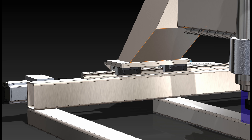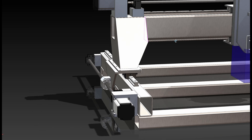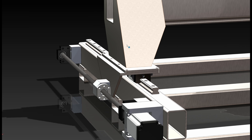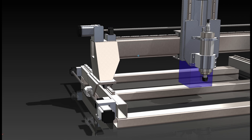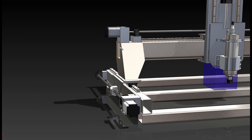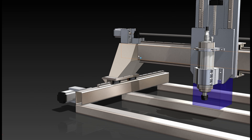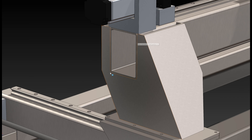The bottom plate is the piece I put on first. For assembly and welding: first I'll make the bottom part, then weld together the box shape and bolt that onto the bottom so I know it's in the right position. Then I'll slide in the gantry tube, make sure everything is lined up, and start tacking, then weld it in place.